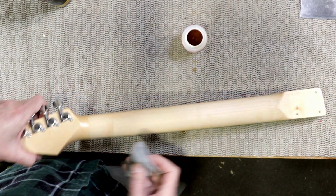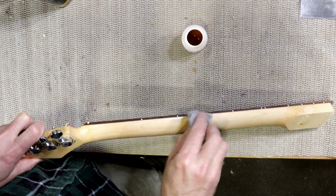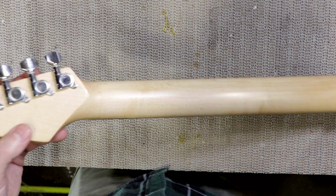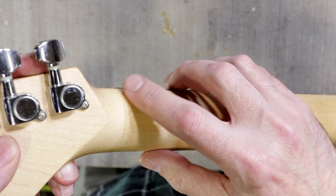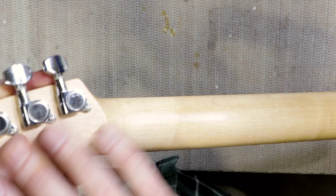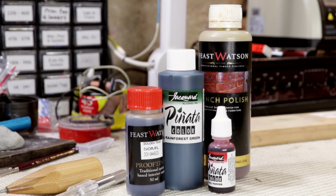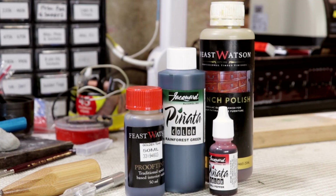So that's 3 wash coats of shellac. It's a bit of an issue though, and that is because I was originally planning to finish this with Danish oil, in other words a wiped on finish, the same as I did with Project Berocca. And for that reason, I've created a really nice clean line. The trouble is though, with the stain that I'm planning to put into the design, well, I think when I go to wipe on that first coat of Danish oil, it's very likely to make the ink run and smear.